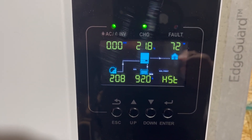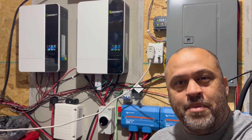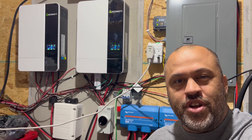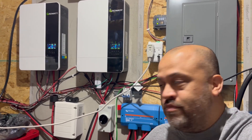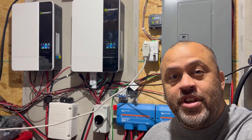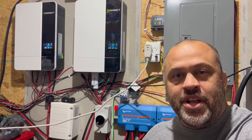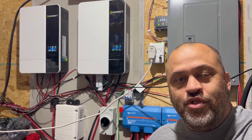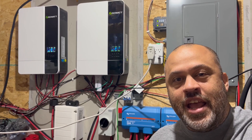We'll see if this thing works, and if it doesn't I'll give you another update. After the firmware update, the battery and inverter readings matched up for a little while but then got about 20% off. So I drained the batteries all the way down and recharged — they're back to about 90% and matching up now. I'll check in the morning once power gets used and it's not charging at the same time, to see if it still matches or freezes again. If you like this kind of video, subscribe, hit like, and thanks for watching.